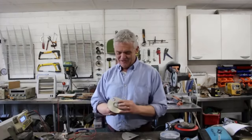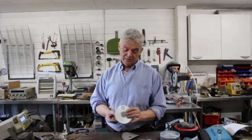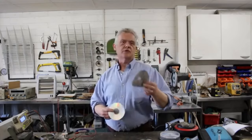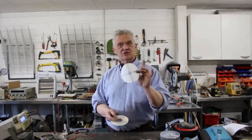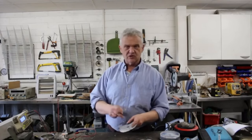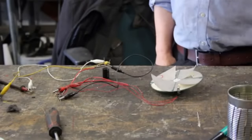Remember: as electrical machines go, motors and generators are the same thing. So we've now got a three-phase generator giving a single-phase DC output. What's really cool is these motors fit a CD beautifully — they're made to do that and they're beautifully balanced — so we stick a CD on there and that's the basis of a wind turbine. I've got a bit of Tyvek — although you could use stiff cloth — with lines drawn on it. I put strips of super glue here, here, here, and here, press it down, wait for it to dry, then slice up to make a flap.